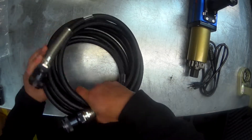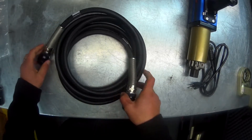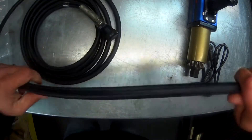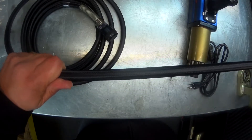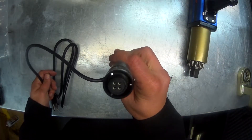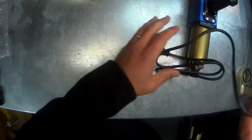The best way to do this is to roll out the cable and inspect the entire length. When using an extension cord, make sure the cord is a minimum of 10 gauge and no longer than 30 feet. You need to be sure to check the power cord's connections and cord itself for any damage as well.